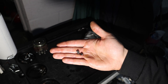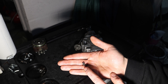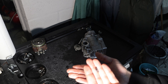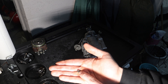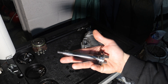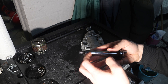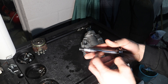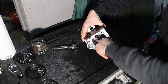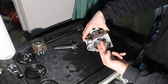I just had to take off the main shaft because the smaller key for the pump internals actually fell out inside of the pump, so I had to retrieve that. The big key is for the hub inside the timing case and the small key is for the internals of the pump itself. The pump internals and the shaft are actually in really good condition — there are visible signs of utilization but nothing I can feel with my finger. Really nothing, it is in really great condition.